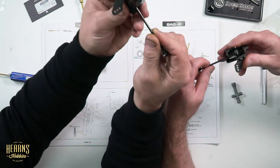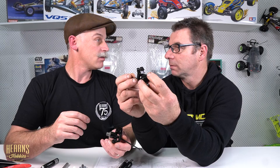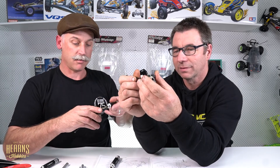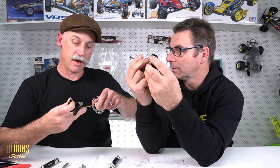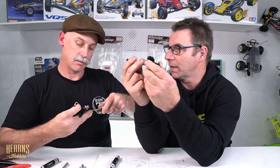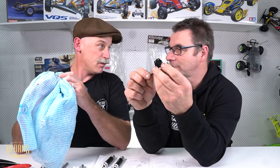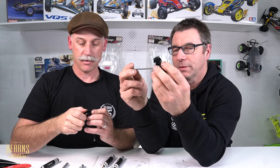That is a tough assembly, isn't it? You're not going to break that - people don't even bend them. I'm just wondering what's going to happen when you drive it. No - the arm will just snap and I'll stop. I've replaced one - I fixed it for him - on an HB. It was actually bent. I straightened it myself in the lathe. I made a mandrel to go around the shaft and hold it one end and then just trued it up. That's pretty fancy.